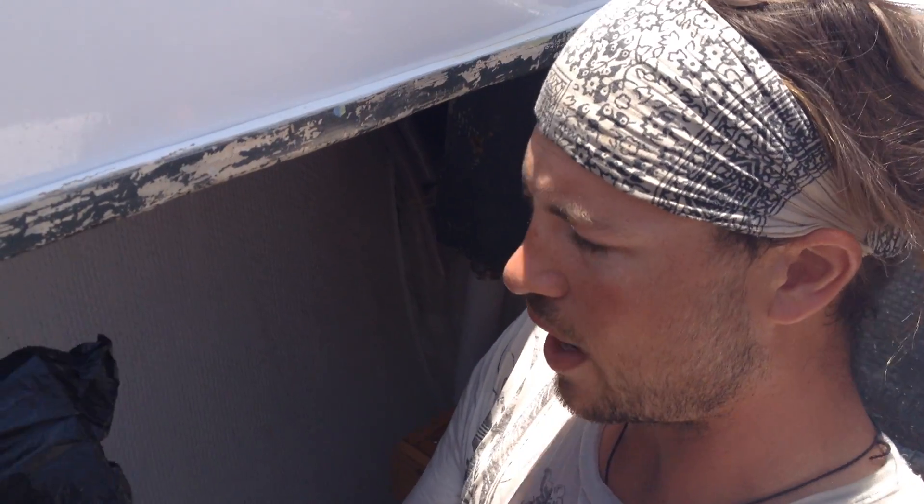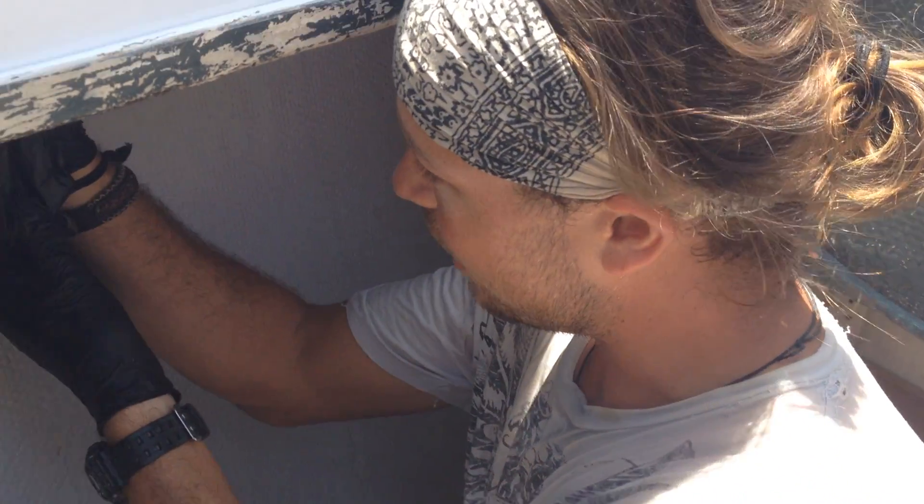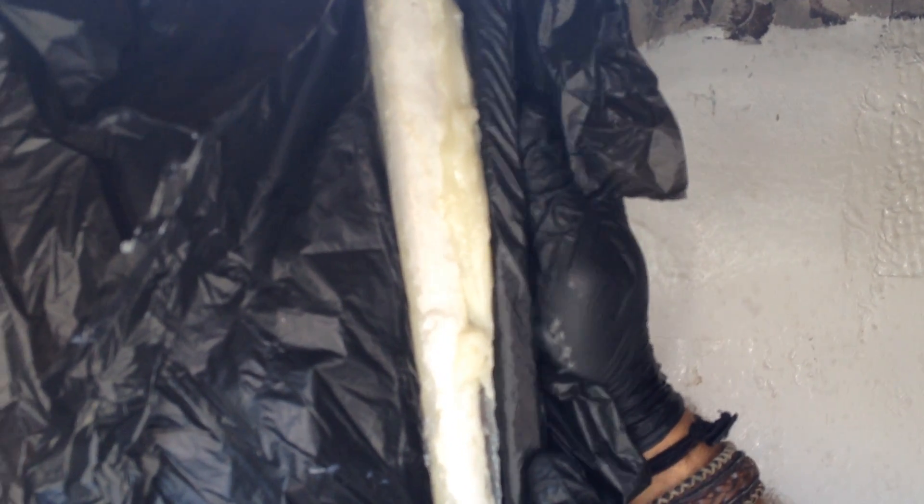And then finally we get the board — got a little board that is just the right shape for the gusset. Put a plastic bag over it like this. And then, once I get enough epoxy on here, just to save us time, we make it perfectly flush and fair by just kind of working this board here until all the excess epoxy is squeezed out, and I can feel it kind of rubbing up against a little bit of the glass.